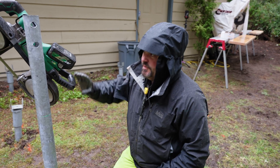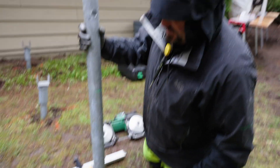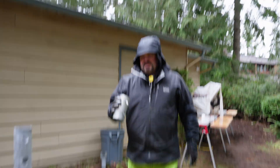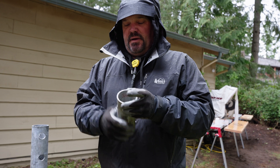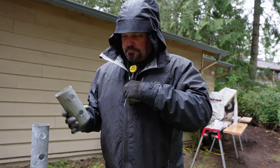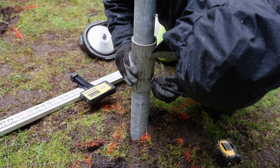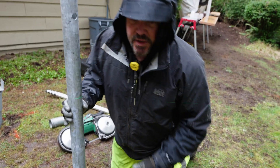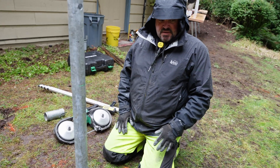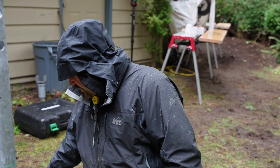There are a couple different ways we can draw that line. We can take a sleeve that we put on here and draw all the way around it, which sometimes comes in handy. This is a sleeve we use to drive our smaller piles - sometimes we have a bigger pile around this diameter, and then we have smaller ones as well. So we just go down, find our line, and draw around it like this. It just helps us get a little more accurate when we go to cut. Now we know our elevation and where to cut the post. Some of the piles we've driven all the way in and they're already low enough, so we don't have to worry - we're going to add a little bit of lumber to make those the proper height. We're just concerning ourselves with the piles that are a little too tall.